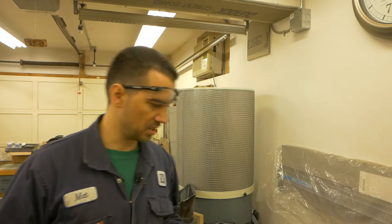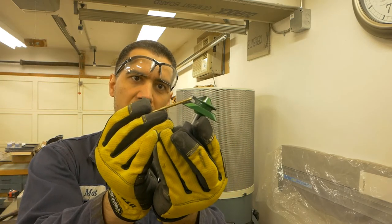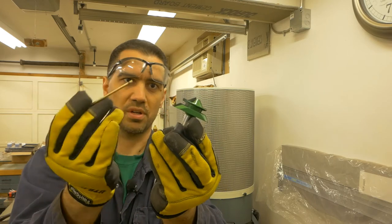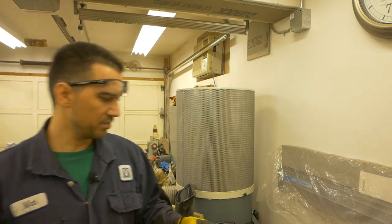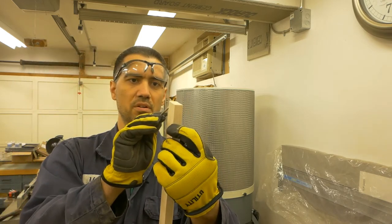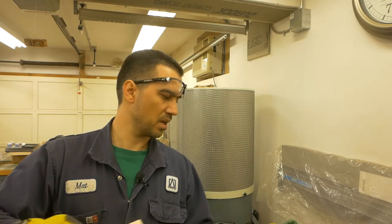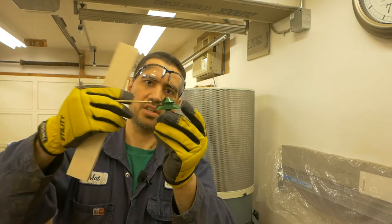So what does aligning at the center mean? We already measured the thickness of the material, and we know where the half point would be, which is 7.35 or 7.4 millimeters. So what that means is on the bit, we need to align the bottom of the tongue cutting edge or groove cutting edge, whatever side you're looking at, this particular edge, with the center. I have decided to go to the table saw and cut away some material at the right height, so that when I'm at the router and aligning it, everything is going to come nicely and I can basically see the wood touching the bit. So let's get to it.